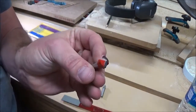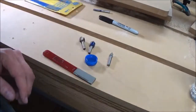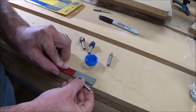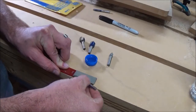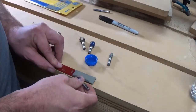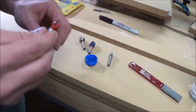With your bit marked with the Sharpie, dip it in water just for a little lubricant, then get your edge good and flush with your file - as flat as you can - and just move it back and forth. We're not going to press real hard, just do it a few times, then flip over and look at it. You can see right there I'm missing just a little bit down here on this corner and a little bit up top, so we'll run it for just a second more. The edge is coming out good.